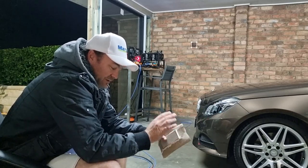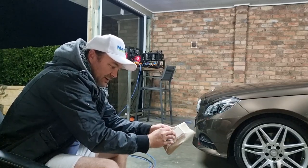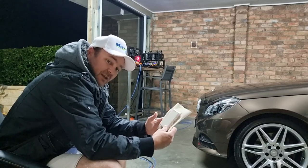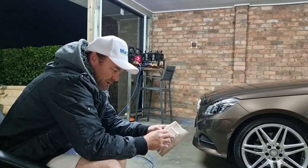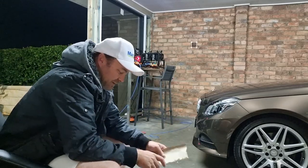When you mud up around, you'll see in this video, make sure there's plenty of mud around here and some mud in the back. If there's not mud behind here, it could bubble. So you want to make sure this is all mudded up. You stick it in and then you blade it out, as you'll see in this video.